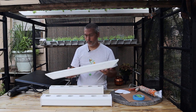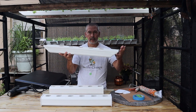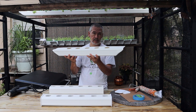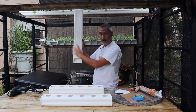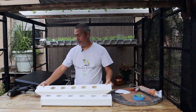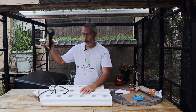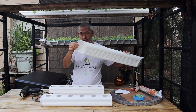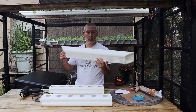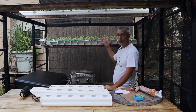The third step was kind of a bit of a problem. As you can see the ends of these are bent. We had to figure out how to keep water inside of here — the round sewer pipes had end caps but these don't, because they're designed to divert water away from your house. What we did was I took a heat gun and heated the ends of it; when you heat PVC it gets real malleable and I would just fold it like a little envelope, and that stopped the water from coming out. These are all bent on the ends and it works wonderfully.